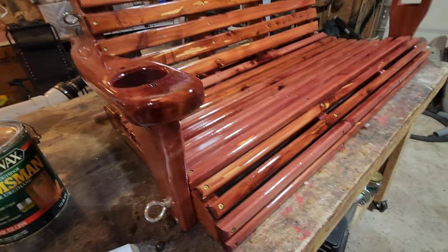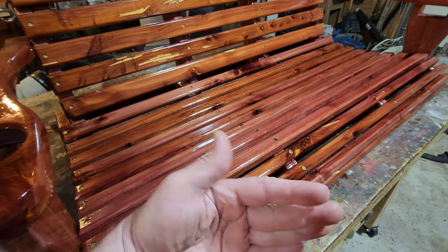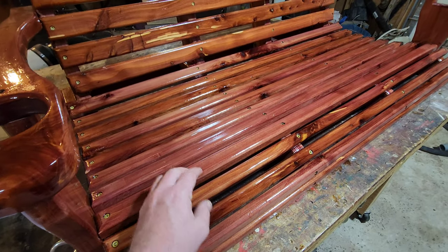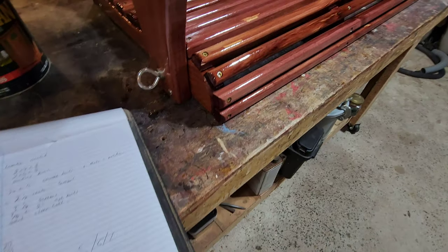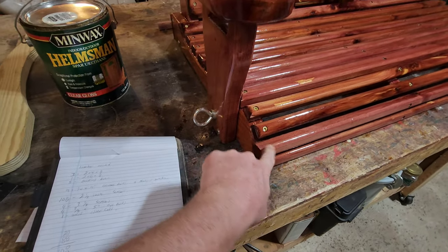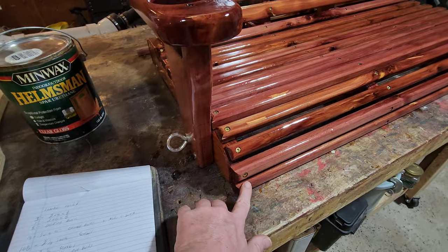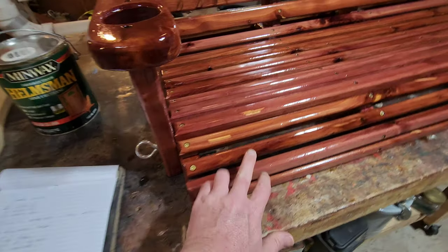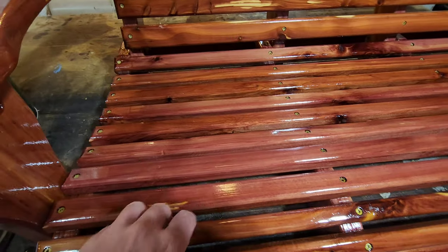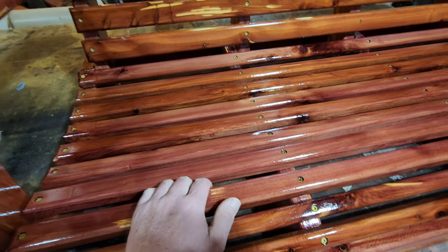Breaking this thing down into the slats the way I did them. Now, I'm going to make this suggestion that you do it this way for the seat because of the curvature. Cutting them the widths that they are here works out the best for the curvature. The first 4 are 1 inch wide. All of this is 1 inch thick, all your slat material. These are 1 inch wide, and they're 4 foot long. You've got 4 of them, 1, 2, 3, 4. Then you will resort to 8 of the 1.5 inch wide by 4 foot.